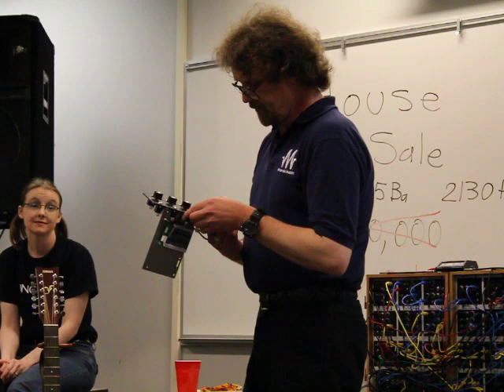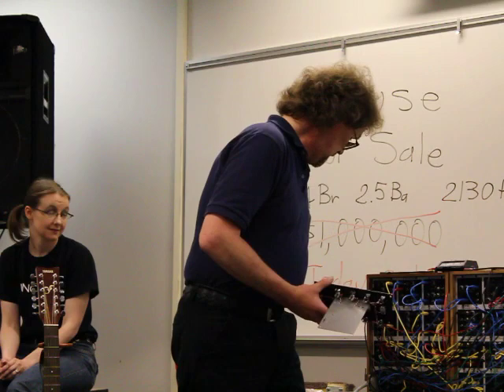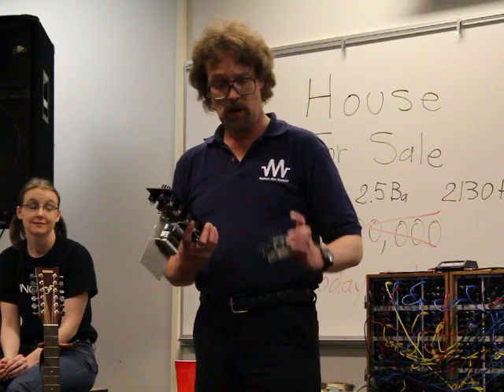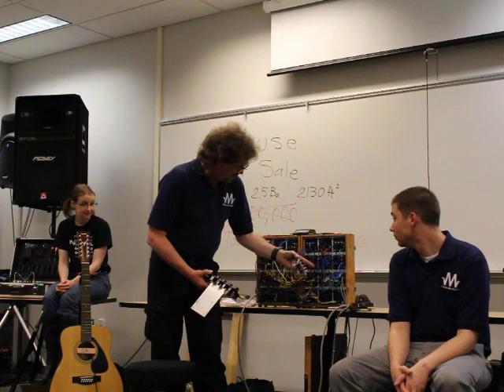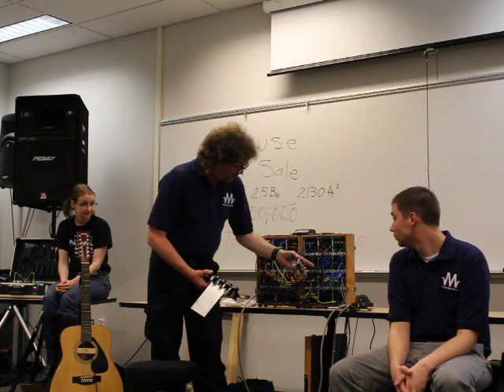Bright Chamber — my voltage-controlled mixer, which is basically a quad-VCA and a mixer unit at the same time. People kept asking me to break the channels out independently, so I came up with a new product called the quad-VCA, where each channel is brought out individually and can also function as a mixer. I also came out with a quad AD/ASR envelope generator — four different ADs, simple utility modules, each with a dip switch on the back that DIY builders can bring out to the front panel, set to either attack-sustain-release or attack-decay.